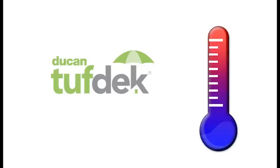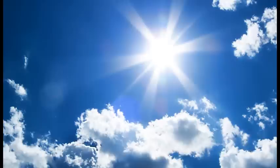When looking for the perfect day to do your project, we recommend taking precaution with extremely warm or cold weather. The perfect temperature is between 10 to 25 degrees Celsius. Direct sun or extreme heat on the deck will cause the product to dry too quickly, which will make it difficult to spread. If heat is in question, always test the deck surface with your hand.